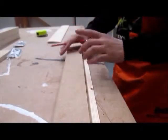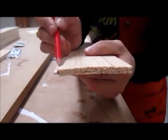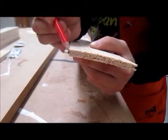Just like so. So just one more time guys, because it's very, very important. When you're pulling the 63mm measurement, try your best to always remember to hook on from the square edge of the shoulder here.